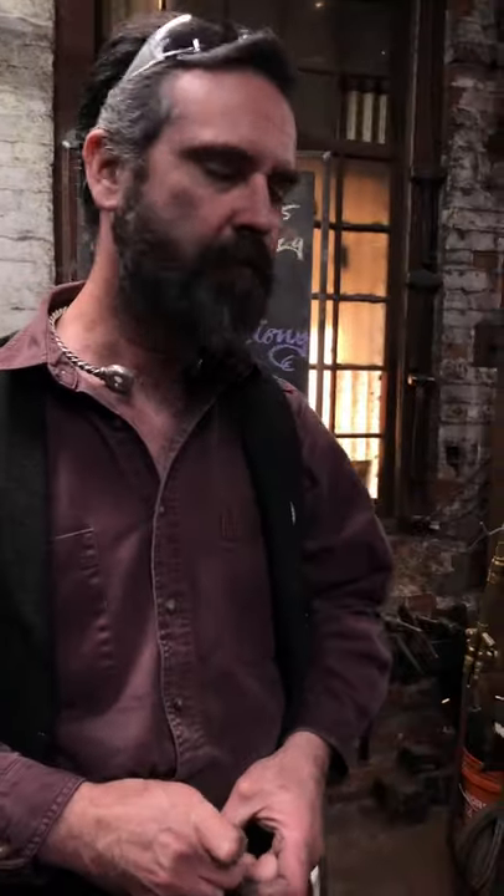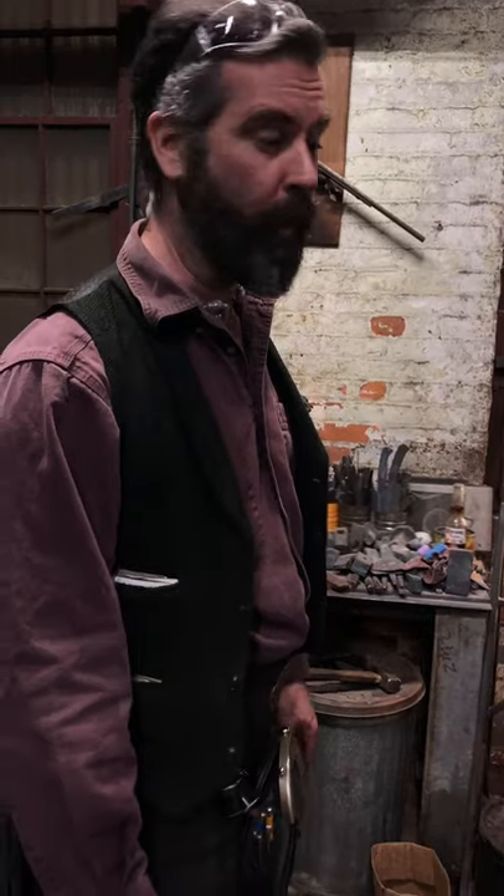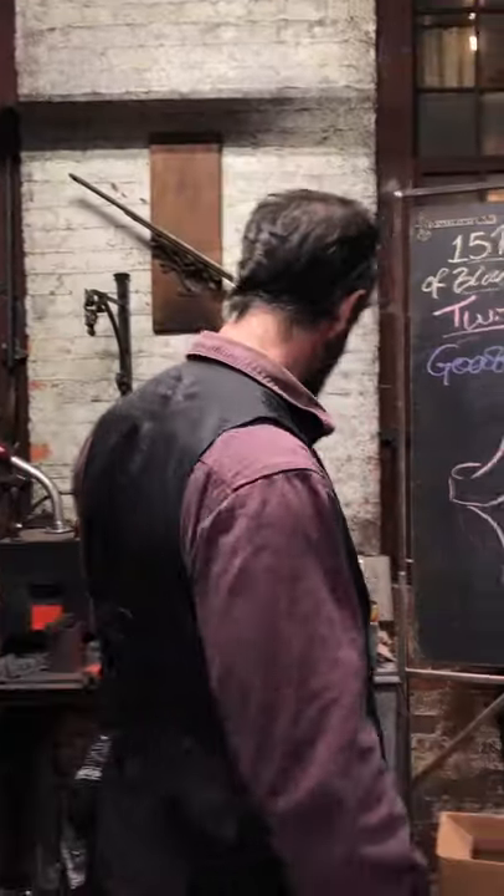Chiseling and chasing — if you don't know how to do it, go watch the videos on chiseling and chasing. Basically I laid my lines in cold, then went in deeper hot, and then even deeper for a second pass. So don't skimp on your hardware. There are also some really fun ones where you chisel it, twist it, chisel it again, then untwist it. That gets you into things like the weird pineapple twist and all that kind of nonsense.